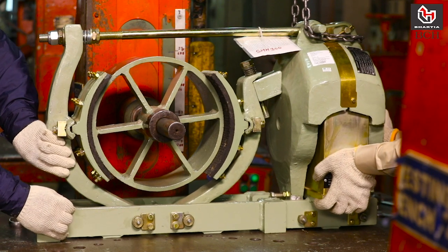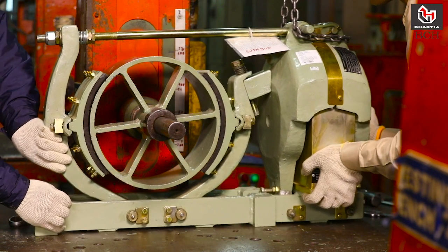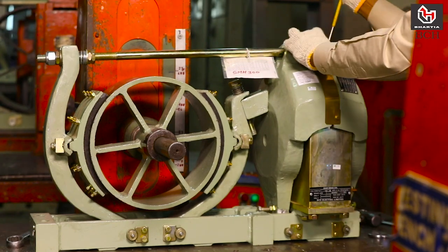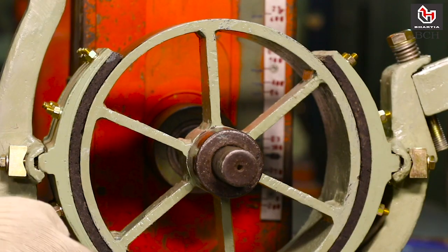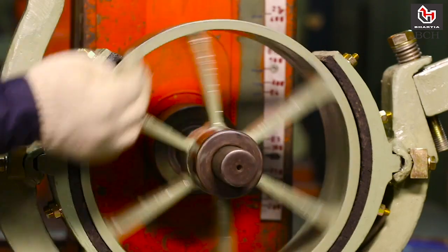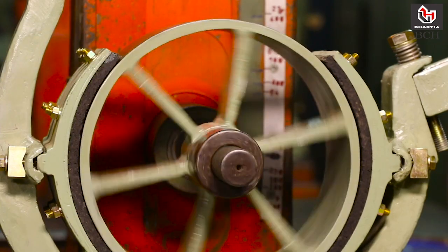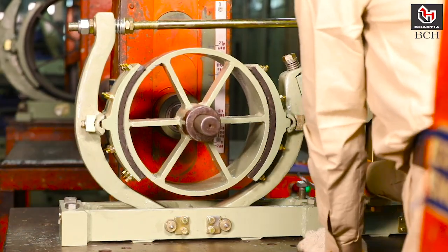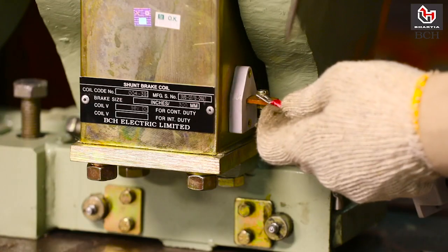Bring brake close to wheel and gently align the brake from front. Remove the hooks from brake by removing split pins. Set the wheel and brake perfectly aligned so all lining surface evenly cross wheel. Put the mounting bolts, to be tightened fully after alignment of lining with drum.